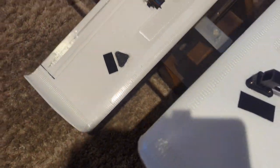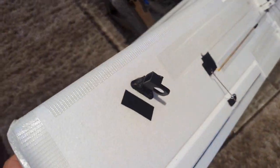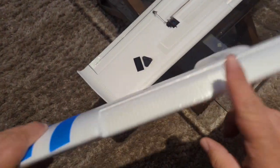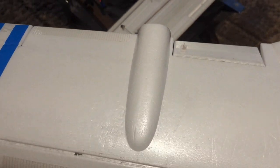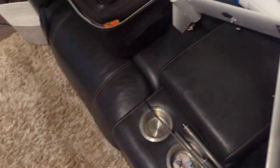Both wings have a hard mounting point for the camera, and then I put some velcro where I'm going to hold the battery — so when it's flying, the mount can be put on either the left or right wing with a small 450mAh 2S battery to power it, right behind the mount. That's basically the way I built it. I like to put tape on the leading edges and trailing edges to protect it from hangar rash and transporting.